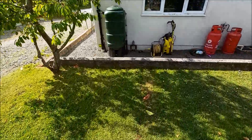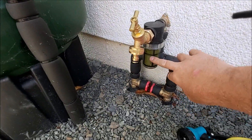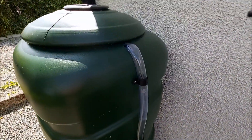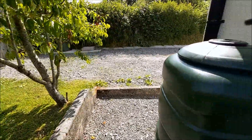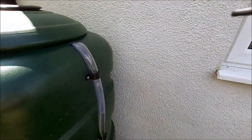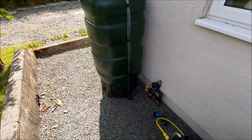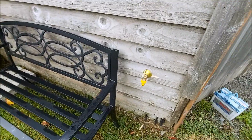At the moment I've just got a gravity tap here with a fine mesh filter, so what comes out is pretty clean. I've also got a clear pipe on the side of this rainwater butt which gives me a level indicator. I made sure all the butts were level at the same height, so as they're all linked together the water level in them all is the same. At the moment we're up here and I've probably got a good thousand litres of water there right now.